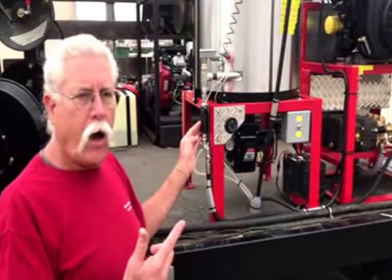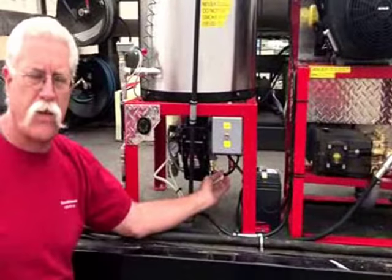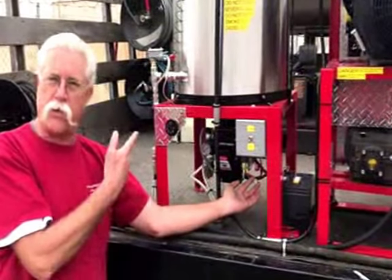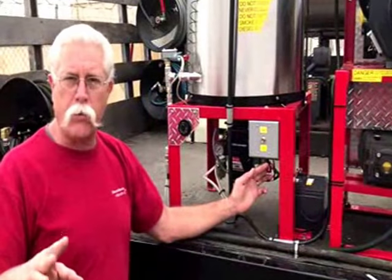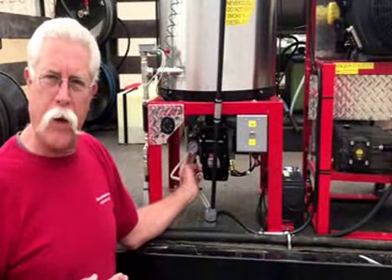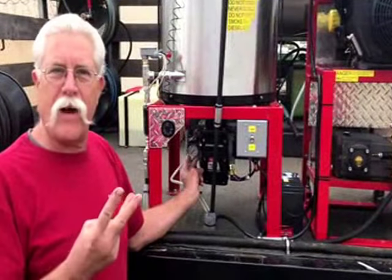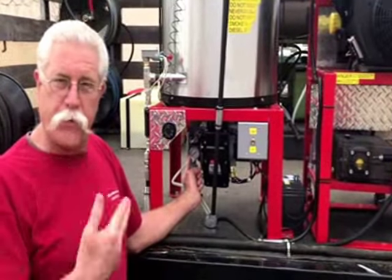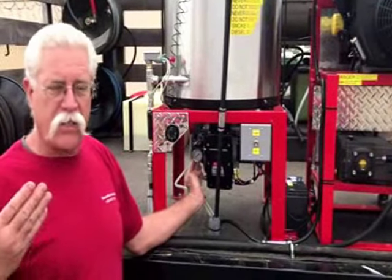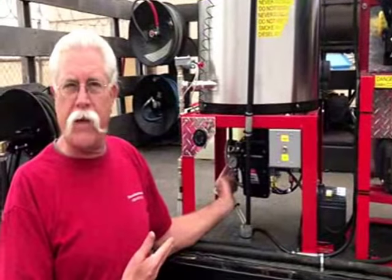This is how to make things reliable. We've put an indicator light on the control circuit that tells us power is getting through the control circuit to the relay. We've got a light indicating there's power going to the control circuit, so you know when troubleshooting where the problem is. Troubleshooting is done in five minutes. We put a pressure gauge on the fuel pump so we have an indication of whether you've got fuel, whether the fuel pump's turning the right speed, whether the pressure is right, whether it's clogged or blocked. The fuel pressure reading every day is an indicator that there's nothing wrong with that half of the system, so your troubleshooting is down to just a couple of minutes.